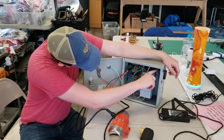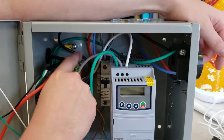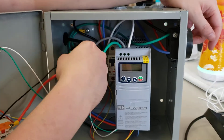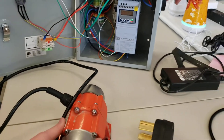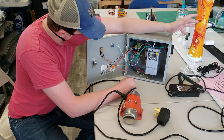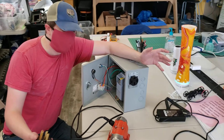So we have our ground here, which is going back to the ground bus bar that I have here, which connects to the enclosure, connects to the outlet's ground, and ultimately connects up to the motor. So everything in here is grounded. The VFD itself is grounded. This device is as safe as I can make it. This results in a 240 volt three-phase power output.